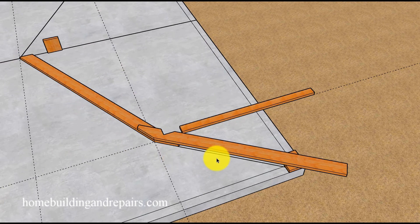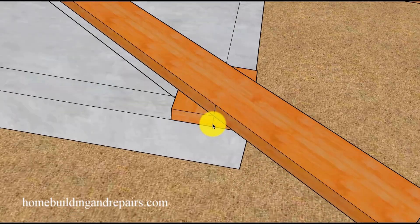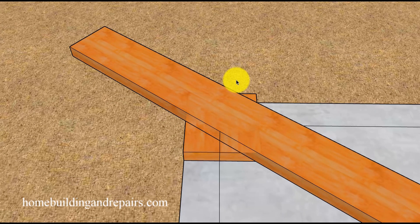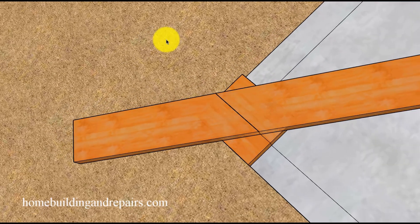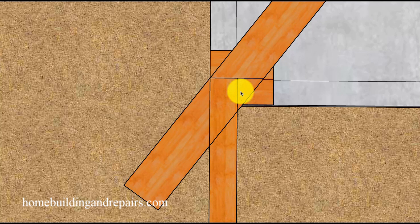After everything is positioned properly, it is time to lay out the bottom of the lower rafter. The first step is to create a line that will represent a horizontal line for the roof framing rafter — this line can be used for the rafter to sit on top of the wall framing or even on top of a floor. Our roof rafter is going to be sitting on top of a 2x4 framing plate, so we need to draw lines to represent the width of the wall framing plate — three and a half inches — extending parallel to the outside of the building.